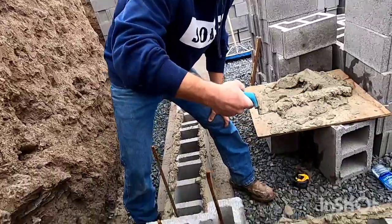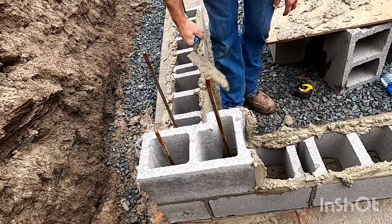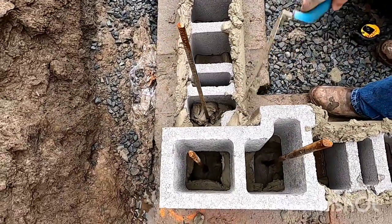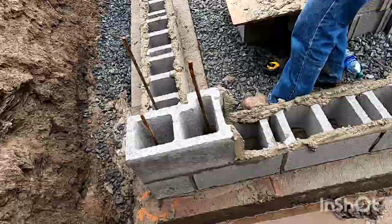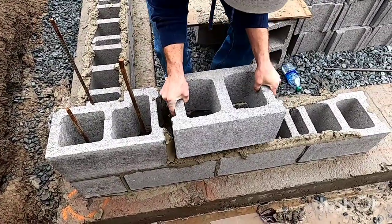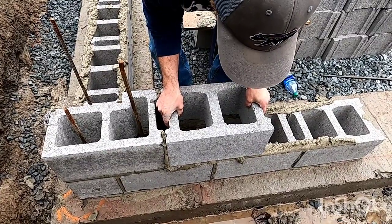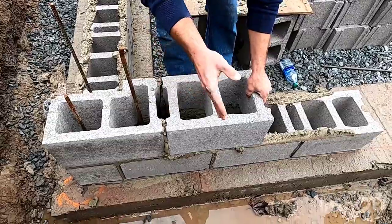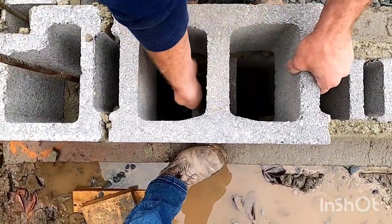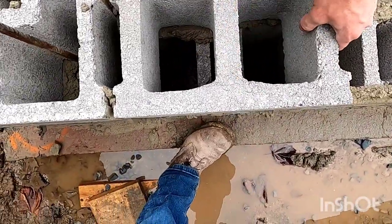Okay. Same thing as the bottom course, just head them up on the wall here. Make sure you're getting everything sealed up good. All right, about setting these, it's all about how your wrists are. And your goal is to set it as flat as possible and look down right on that outside edge of that block. Can you look down this core? And you gotta make sure you're hitting the center of these webs here. Like over here, my center is hitting right on.